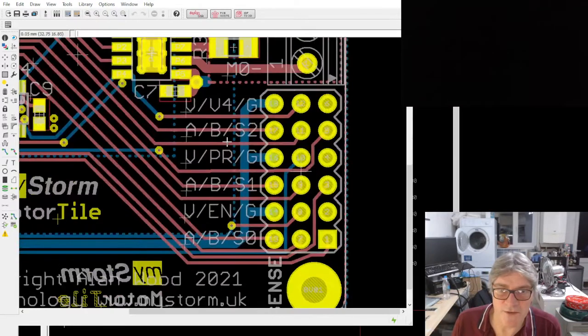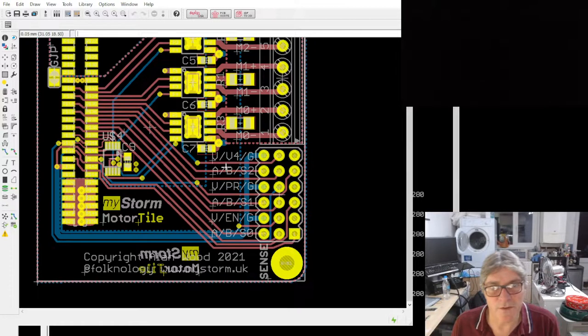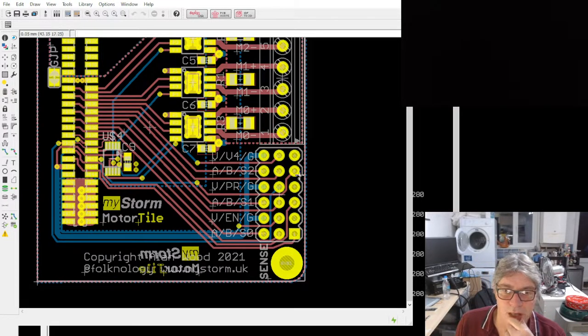No, those are really just for end stops. That's their primary purpose. So you've got encoders plus you've got end stops. And the encoders can take two different forms, like quadrature encoding, or you could drive them on I2C if you wish. For the I2C, you probably want to terminate the I2C device with pull-ups, because we don't include them on here.